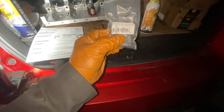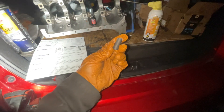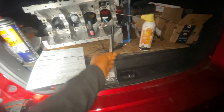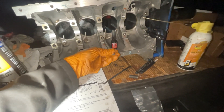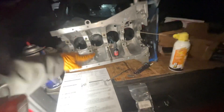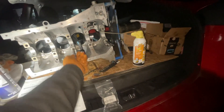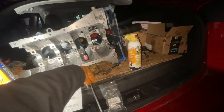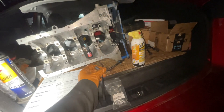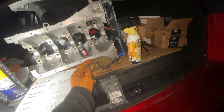The inserts we're using are part number 11155 — they're 30 millimeter steel inserts. Once you have the hole made, this is one I just finished drilling the threads on. You carefully tap in the new threads, and remember to always lubricate your threads. Then you use the driver and carefully install the steel insert, making sure it's snug and everything is lubricated.